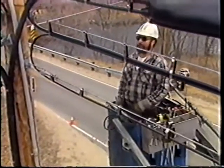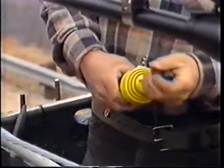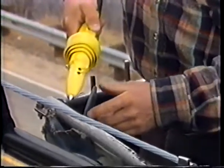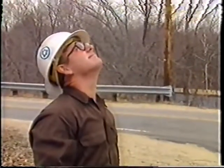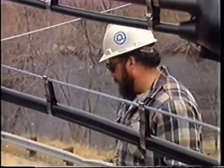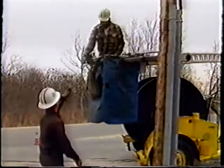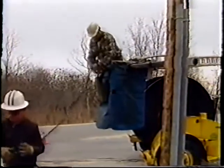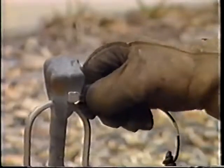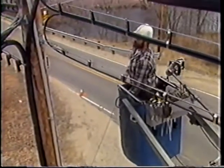As you approach a work area that's in close proximity to power lines, you may encounter other factors that you can't see. In situations like this, a blinking red light may be an indication that induced voltage caused by an electrostatic field is present. Got a red light up here, John. Although this type of induced voltage isn't dangerous, it makes the 188A's readings for other voltage inaccurate unless the induced voltage is bled off first. This process requires that you ground the test set using a W1BU cord.